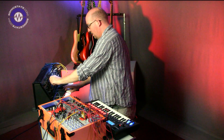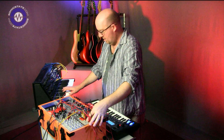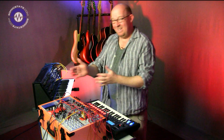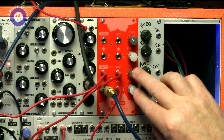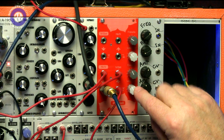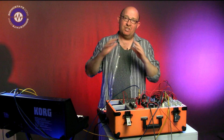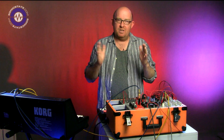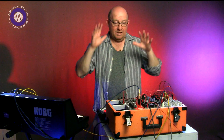So now I've got two oscillators, two different filters, and that works. It's a little bit finicky to begin with, but the trick is you start with the knobs at roughly 11 o'clock and work from there — as it happened, that's where these ended up. You play your bottom C first, tune it, then the top C, tune it, keep going back and forth and you get there. Once set, it's pretty much set and forget. Obviously if you have a hot day or it's had a bump you might need to tweak it, but basically once you've set it up, you can use your MS-20, MS-20 mini, or MS-20 kit to play your Eurorack.